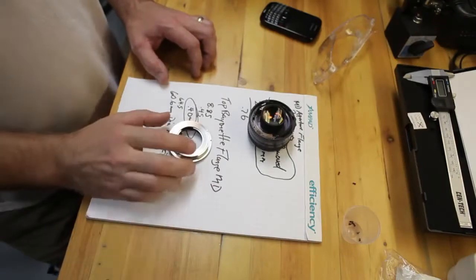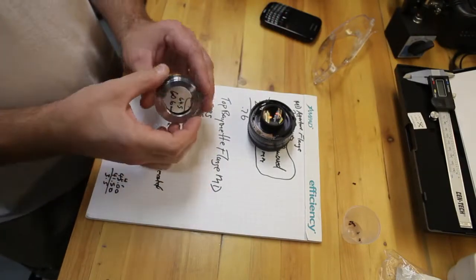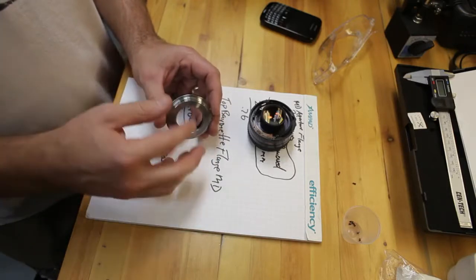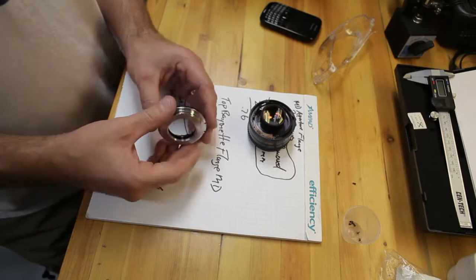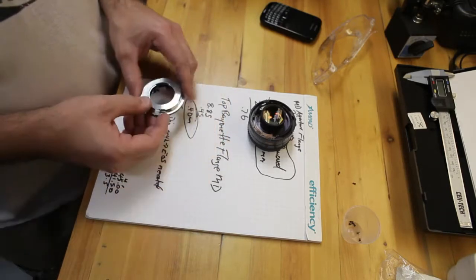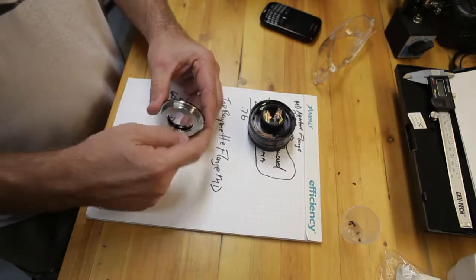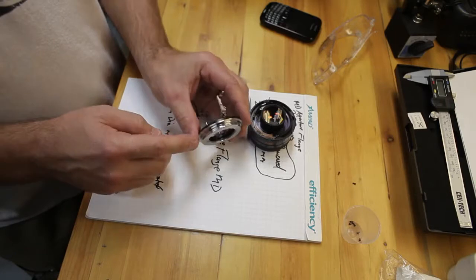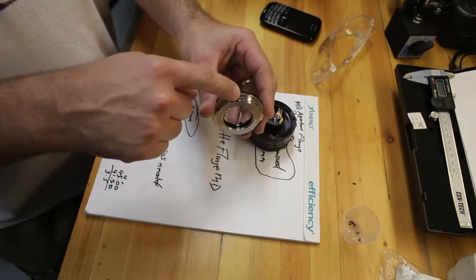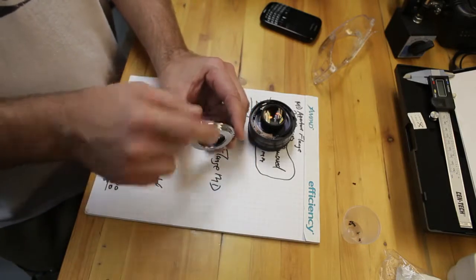Okay, the lathe operations are complete, and here I have the M42 to EOS adapter mounted onto the aperture mechanics flange for the Minolta lens. Real quick here, I turned the outside of the M42 to EOS adapter down to 60.6 mil diameter, so it's flush here.